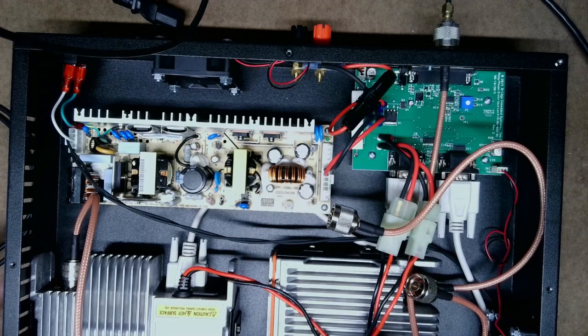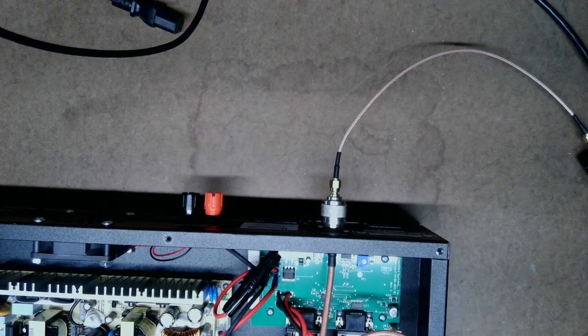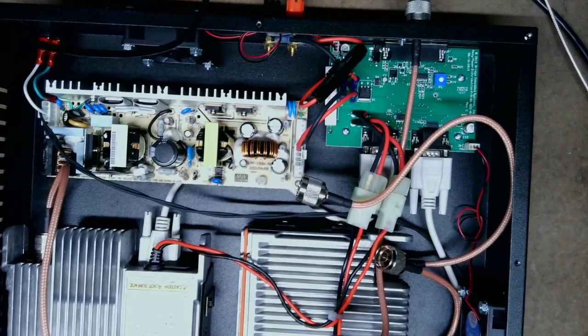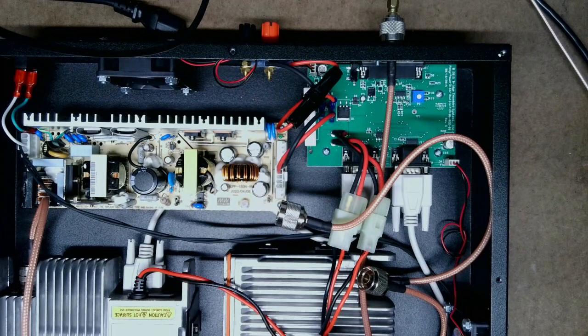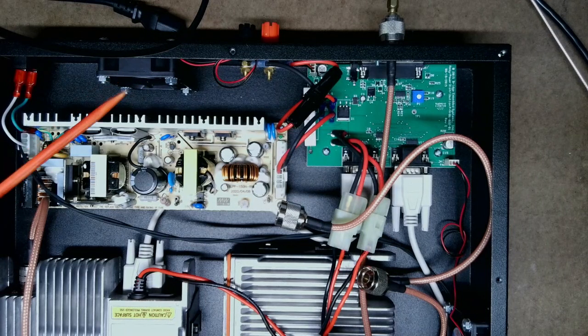To find a replacement fan, read the part number off the existing fan, look it up, and cross-reference the data sheet for the CFM rating. The part number on these fans is DF1260-25BE. Look that up, get the data sheet — it will tell you the CFM and physical size so you get the right replacement. Make sure the CFM matches or the repeater could run warm.